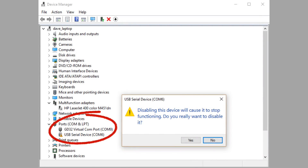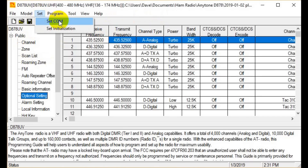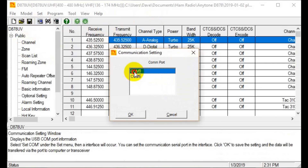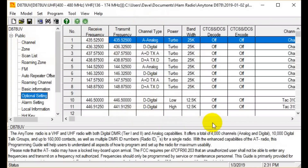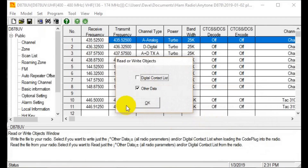Note, I found that Windows insists on installing its own driver, which won't work with the cable. To keep the two from competing, right-click on the Start button and choose Device Manager. With the cable connected to both the computer and the radio, and the radio on, if the GD device virtual COM port has a caution sign on it, then right-click on the extra USB serial device and disable it. Then the GD device can work properly. Once you have this set up, start the version 1.09 programming software, click on Set, and select Set Com. Choose the number that corresponds with the Device Manager's assigned number for the GD port. Then you can read the radio, make any changes you want, save those changes on your PC, and then write the radio with the new software.